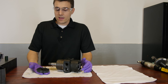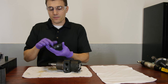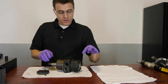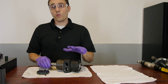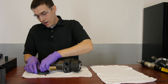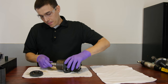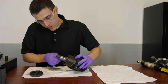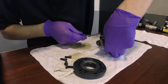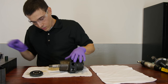A roller motor typically, if you have a leak, it's going to come from one of a few places. It could either be your low-pressure end with this shaft seal here — you can get a seal kit and easily replace that. You have an O-ring here and a few seals back in here. So if you have a wheel motor that leaks, chances are it could be repaired. On the nose, we have the bearing — the shim here is the front bearing race, and inside here we have the needle bearing and the thrust bearing. These bearings can also be replaced, though that's not as common a repair.